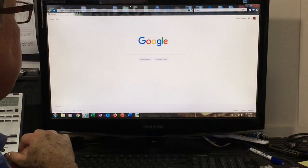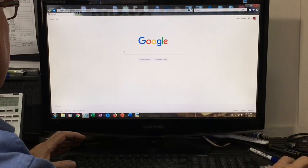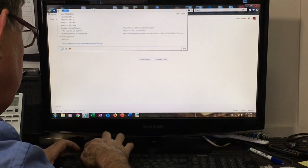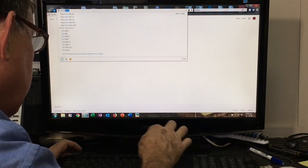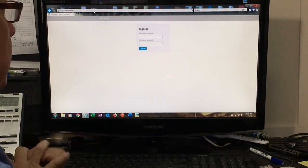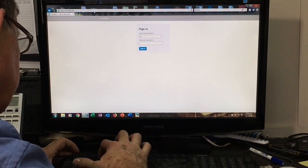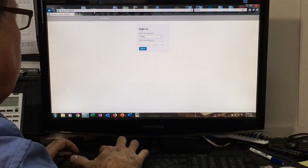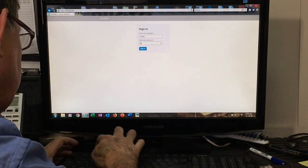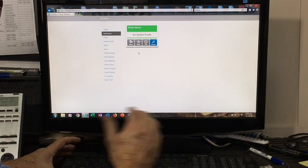Now it's time to go to the computer. The computer just needs to be connected to the same network as your Ethernet cable. In the URL bar, type in the IP address of the CONNAV — in our case 192.168.1.8 — and hit Enter. It will take you to the login screen of the CONNAV. The username is the word 'installer' all in lowercase, and the password is the program code — 9713 in our case. Click Sign In and you'll be connected to the alarm system.